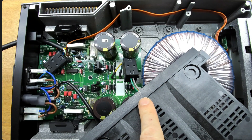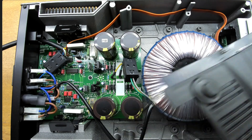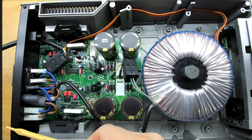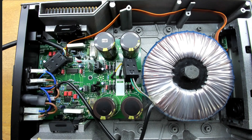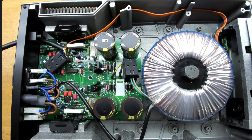There is a little indication on the back — a small spot of something going on there. When we turn it over and look at the outside, we can see clear residue along there, coming from the area at the back. Looking closely, we've got a mystery component here that's wrapped in heat shrink and tied on with a cable tie. This is a Class X capacitor — Class X means it goes across the supply line. It's a simple filter. I'd rather see a proper IEC-type filter installed, but this is just a simple attempt at some filtering.